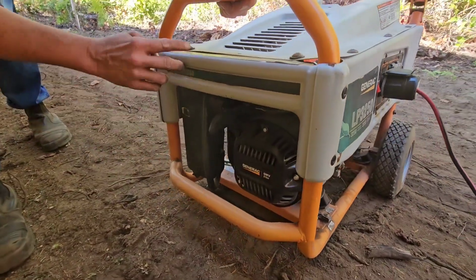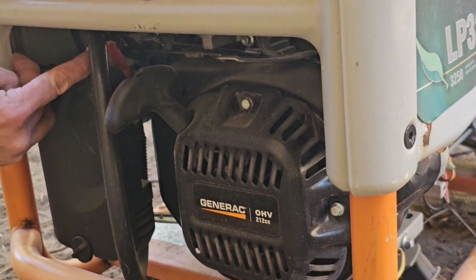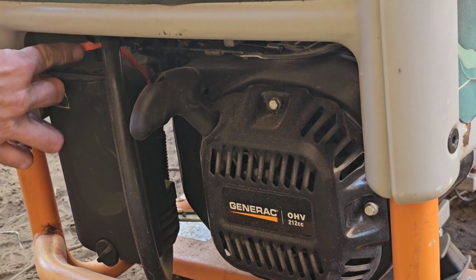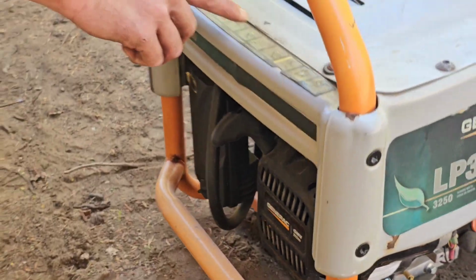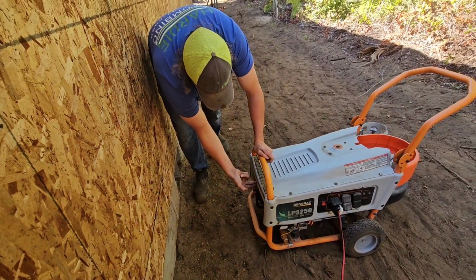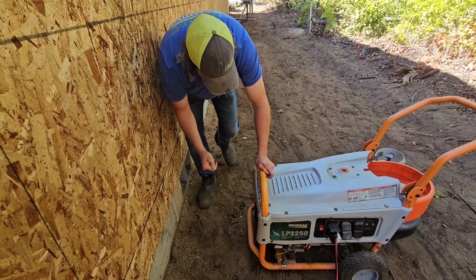So then here, the next step is to open the choke, right? I should say close the choke. Now we're closed. So close the choke, and it wants me to pull the cord 2 times. Then open the choke and pull the cord 2 times, and we'll be on.